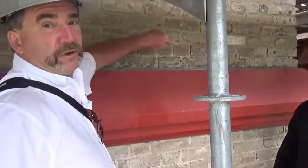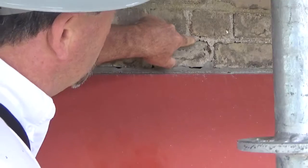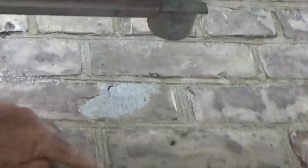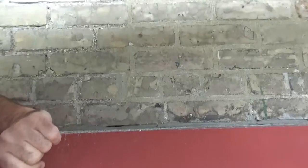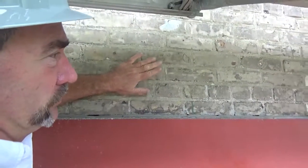It's kind of interesting, this spot right here too, of the masonry, Shannon, that Terry and I are standing beside. We're seeing some, I'm going to bet, original masonry here because I see so much lime in it, eh? And then we're seeing this very, very light top coating that was installed on it, because you can tell, if you get in here close, Shannon, it was not ground out before they actually did this reparging of it, and I'm going to say it looks like it's within the last 25 years, because literally you can see the depth of the reparging work. It's just a skim on top of it, and the skim always ends up falling off because it's not been embedded properly. It was a good way to make lots of money off of the church by doing this without too much work, but say, hey, we did something important.